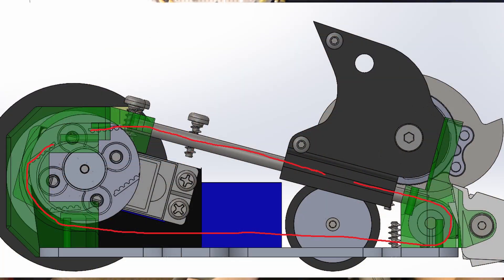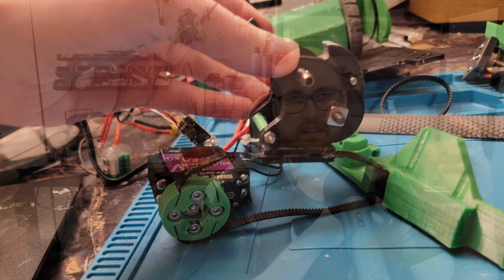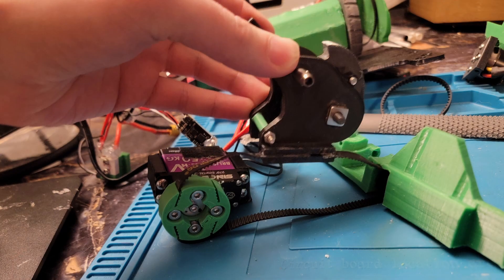The linear mechanism is driven by a servo and a timing belt. The timing belt is fixed at both ends — at the servo side I 3D printed a kind of pulley, though it's not really a pulley since it's fixed at two ends — and it's also fixed at the weapon itself. Basically the servo turns and it moves the weapon back and forth. The servo I use is one that was recommended to me that could run off a 3S battery without burning up. I do find that the timing belt likes to break a lot of the time and the servo can be kind of slow.